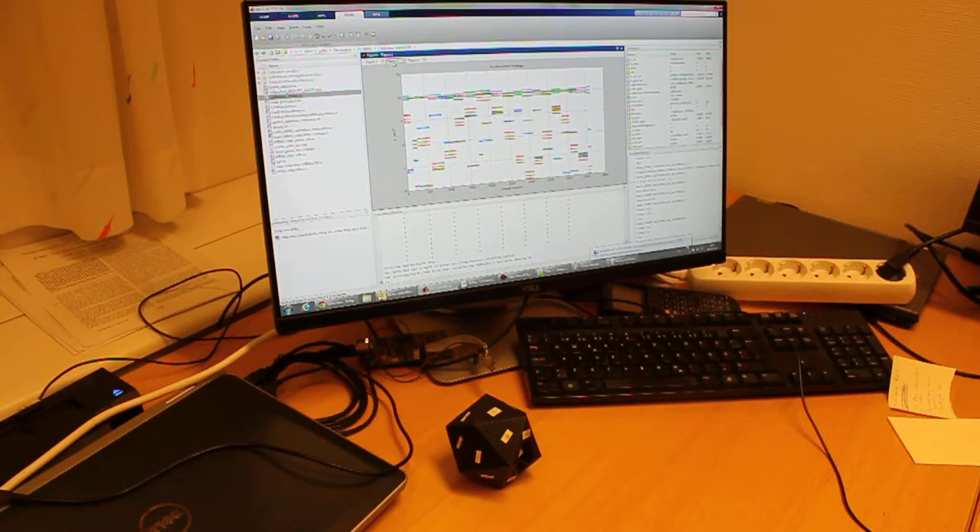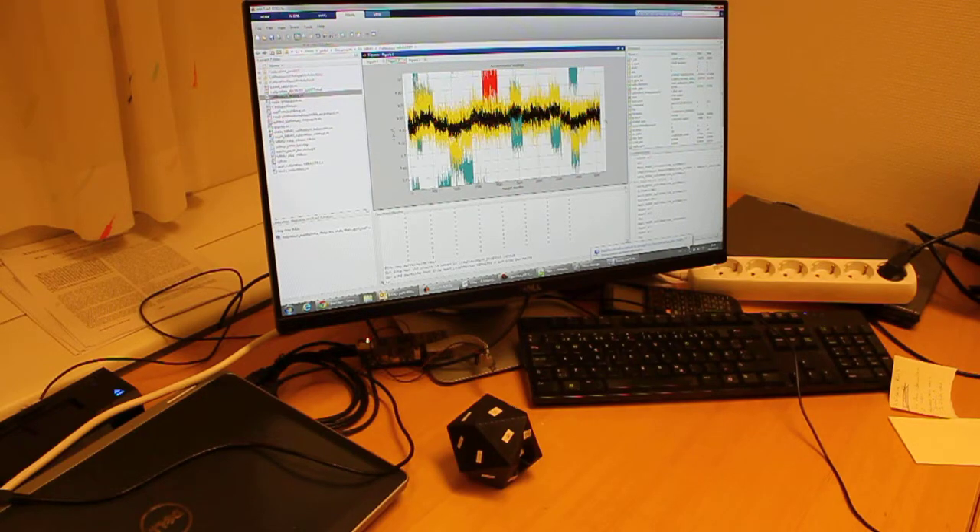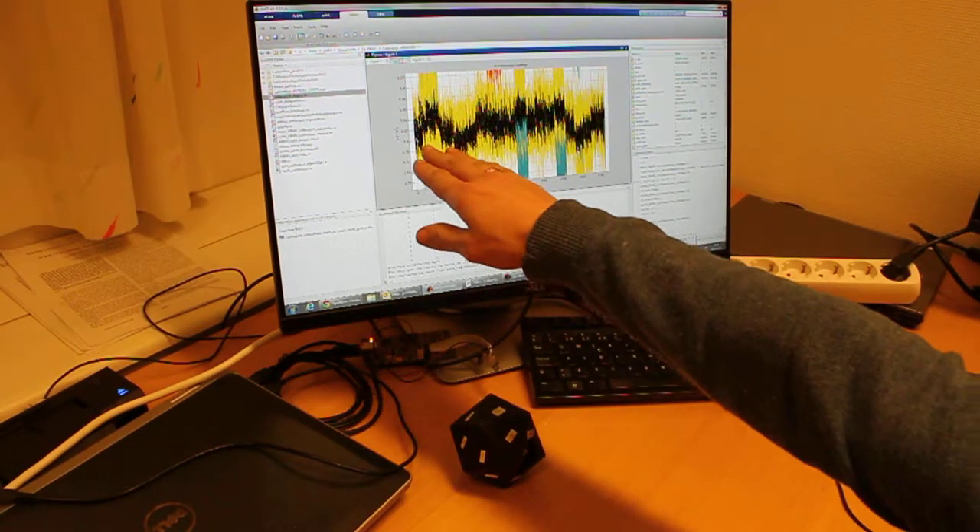In Figure 2 we see the selected specific force data. The raw data from individual IMUs is displayed in blue, green, and red. The compensated data — corrected for the calibration — is shown in cyan, magenta, and yellow. The combined compensated data from all IMUs is shown in black. The corresponding magnitudes are shown at the top in silver, gold, and black. A good sanity check is to look at the combined magnitudes: they should be fairly constant and equal to gravity, which is roughly 9.82 here.